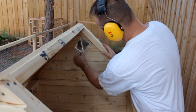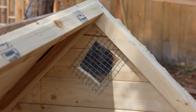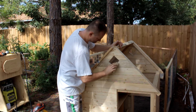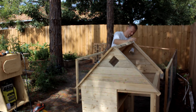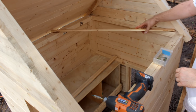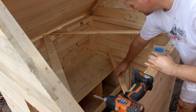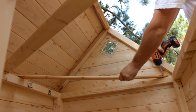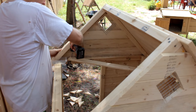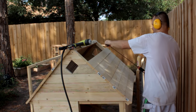A piece of hardware cloth tacked to the inside will keep all the critters out that may be looking for a free meal. A jigsaw leaves a rough edge so I'll smooth that out. Chickens love to roost, and I can give them some space by placing a few pieces of lumber at different angles. The best thing is to use an actual tree branch about an inch to an inch and a half thick, but I'm using some 1x2s run through the router table with a roundover bit to take off the square edges. Then I roughed up the boards a little so it's easier for them to grab onto.